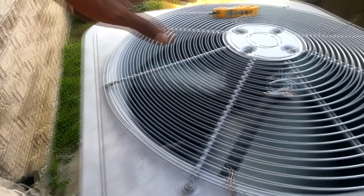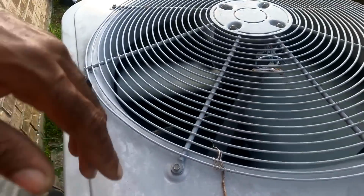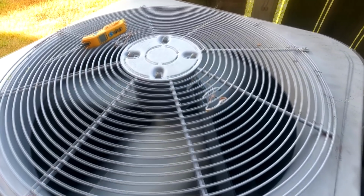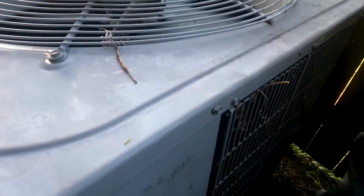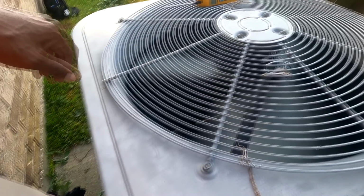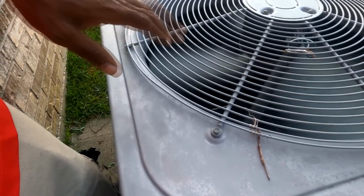What's going on right now? I'm thinking it's low charge. I'm pretty sure there's gonna be gauges up there. Well, I say use your five senses too. I hear the compressor. You do hear it? Yeah, I hear the hum. You don't hear the compressor? But hook up the gauges though. Okay. I think I hear more fan. But like I said, I could be wrong.